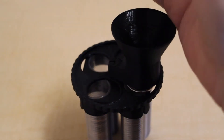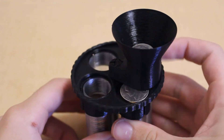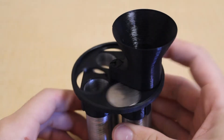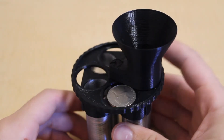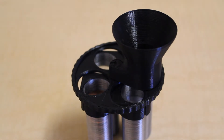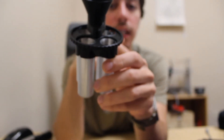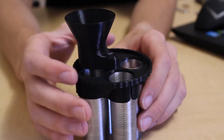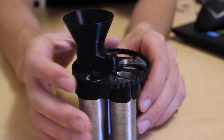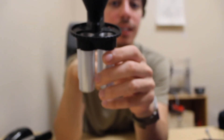One of my most popular requests was to make it so that these sleeves were the exact lengths of what you would do with the paper rolls of coins, so that for the quarters it would be $10, or pennies it would be 50 cents and so on. But the issue that ended up leading to was that when you were spinning this and the coins were just starting to get all the way up to the top, when there was only about two coins left to go, it would actually get jammed because the coin wouldn't fall down properly — there was just nowhere for it to go. So these sleeves are actually slightly longer than what it's supposed to be, and I have separate files that you can print as well that are the exact length, so you just transfer your coins into those and fill that up.